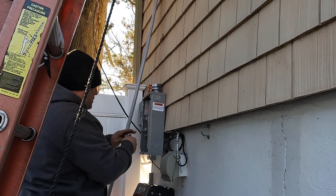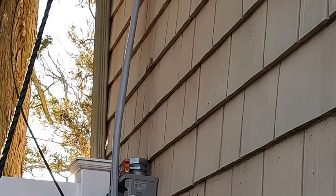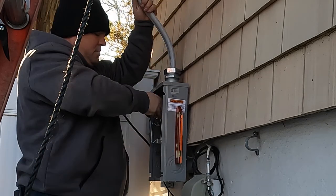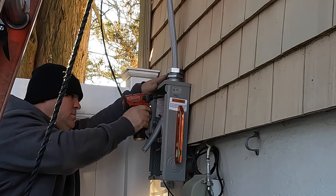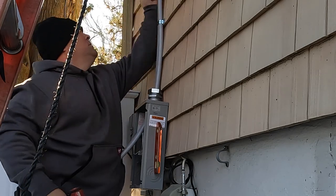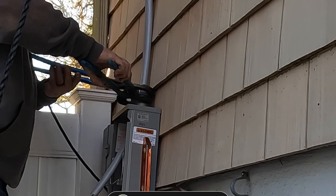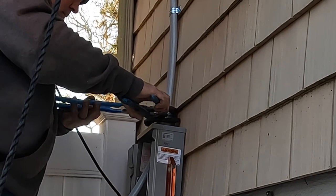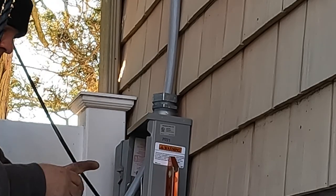Now I'm able to cut this cable and gently persuade the cable to go inside the connector on the top of the meter. I'll loosen it up just enough so the cable can fit through - it's a compression connection. I'll slide the service entrance cable through the connector, then get a couple pairs of giant-sized channel locks and tighten it down. Now I can put my strap in. In order to tighten the compression connector I needed to back off the screws from the meter - I'm struggling to get a nice tight fit before putting the duct seal on in a cone-like fashion on the top of the connector.